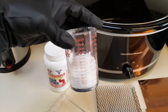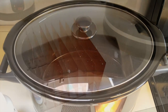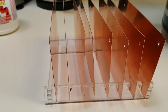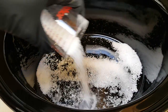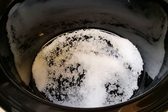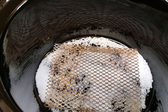Let's go ahead and start putting everything together. The copper plates have been put in their little contraption to sit them upright. Now we're going to take our 50 milliliters of caustic soda and kind of evenly distribute it in the bottom — do the best you can to make it even. Then we'll take the mesh and place that in the bottom, and for the next step we'll take the copper plates and sit them in.